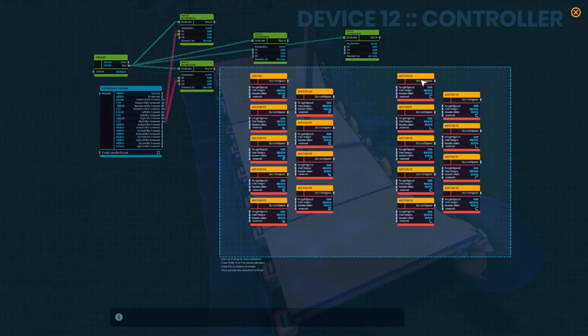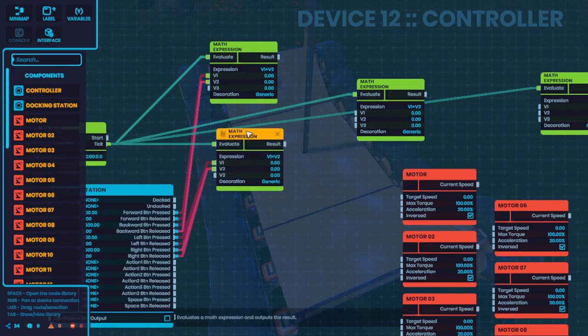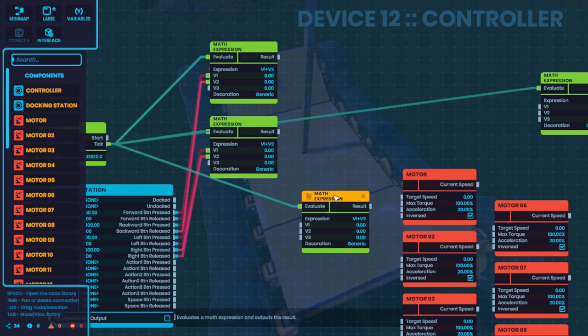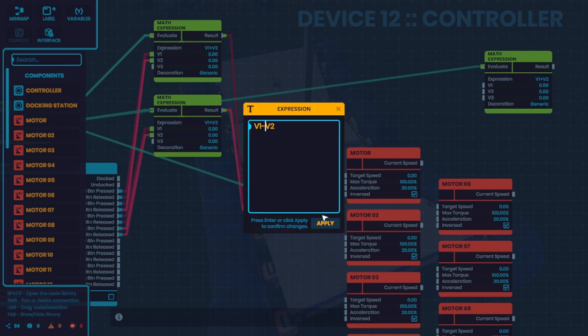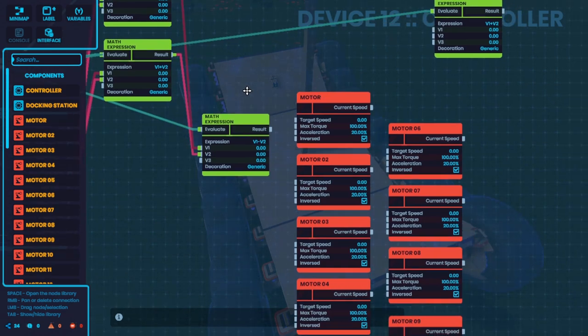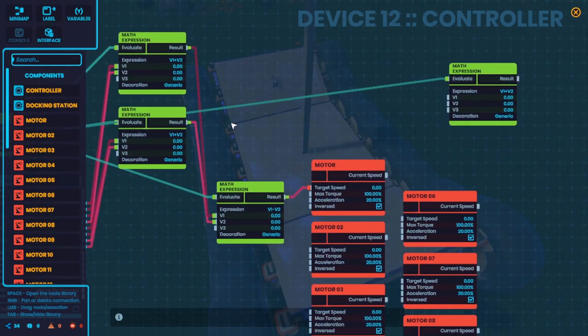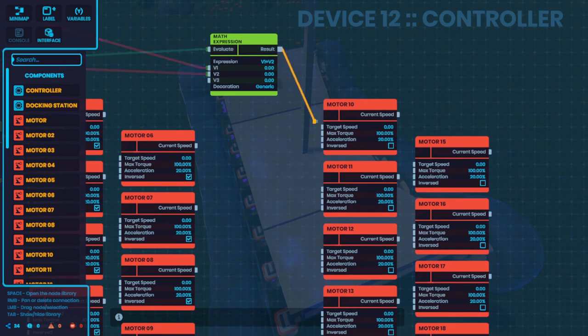Let me move things around so I can see better. On the top I have forward and reverse; on the bottom I have left and right turn. For the left side, the forward and reverse controls go into V1 and the turning controls go into V2, and the expression is V1 minus V2 — so when I press the left button it ends up being negative 500. For the right side, forward and reverse go into V1 and turning goes into V2, but we leave it as V1 plus V2, positive. That's the right side tank control.